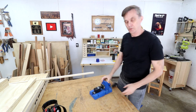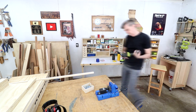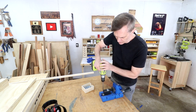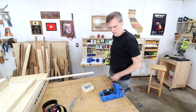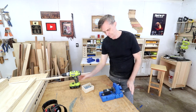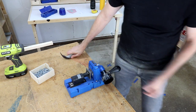I'm going to assemble these cabinets using pocket screws. The way I do this is I just screw my pocket hole jig into my workbench every time I want to use it — just two screws is fine. Then I take the connector for my shop vac off my miter saw and use it here.